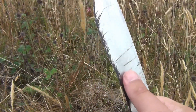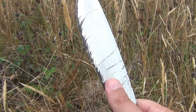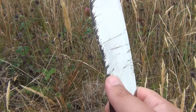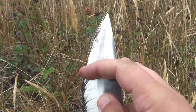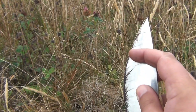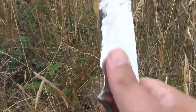Now you don't always want the trapping aspect of this blade. When cutting heavier, harder wood, you often don't want the blade trapped in the wood — if you don't cut all the way through, you can get uncomfortable feedback in your hand. On heavier woods, work up here; if you don't make it all the way through, the blade comes out and you cut it on a second pass without that solid bind.